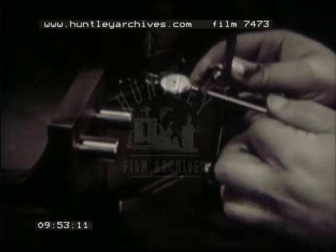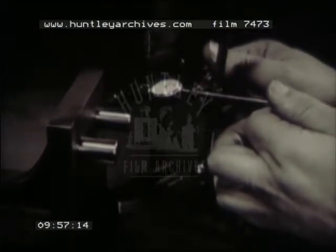Bring the button on the dial indicator into contact with the top of the arm on the height gauge and set the dial pointer to 0. Mounting the dial indicator on a surface gauge facilitates adjustment to a 0 dial setting. This dial is graduated in thousandths of an inch.